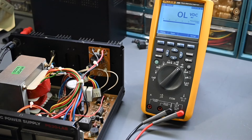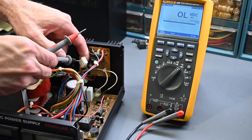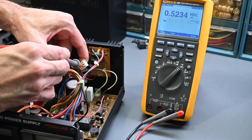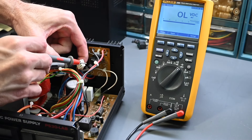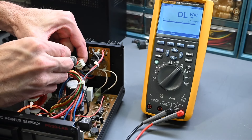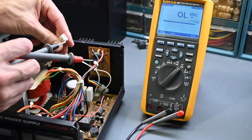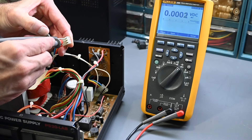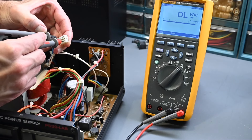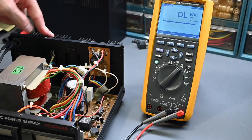The digital multimeter is on the diode test function. Let's test each transistor — the wiring plugs into the board, making the transistor leads very easy to access. Testing the first transistor: that's a normal reading, reverse polarity — no problem with that transistor. Testing the second one: there's the problem — that's a direct short. Shorted. Any combination of leads — that's the problem. This transistor is completely shorted. Really both of them need to be replaced.